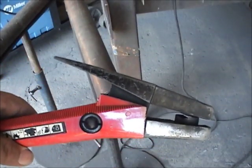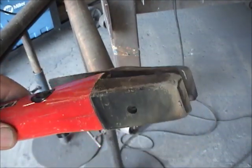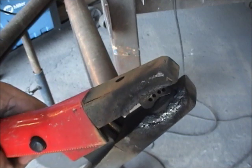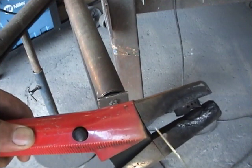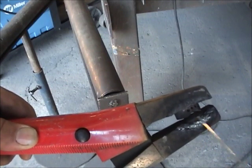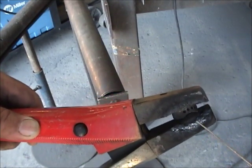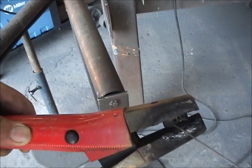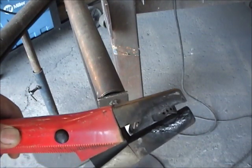This is a carbon arc torch — this is the handle. You see it's got a black button here, and if I roll it over, you can see it's got holes in it. It's also got a lot of damage to it, and we're going to talk about that. The way this damage gets caused is they had the rods when gouging way too close to the holes in this handle. There are four little holes here, and when you put the rods in, you're going to put them in so that the holes are on the underside. You want the holes to be on the bottom — that's the big key to carbon arc.